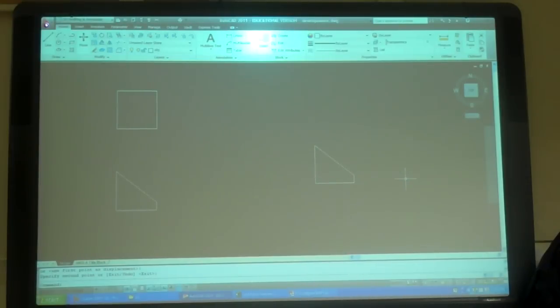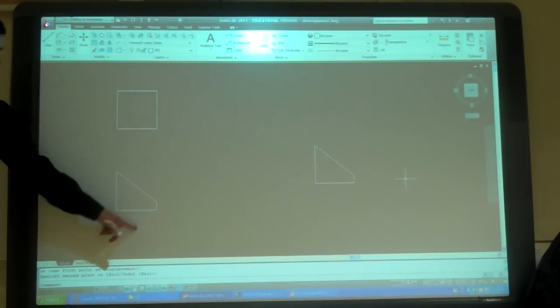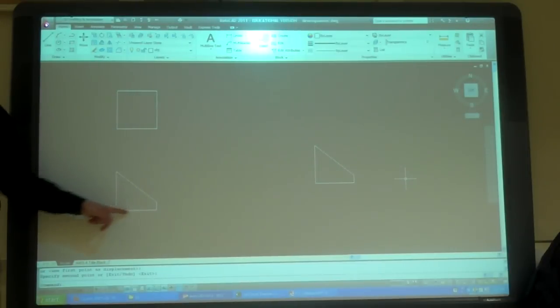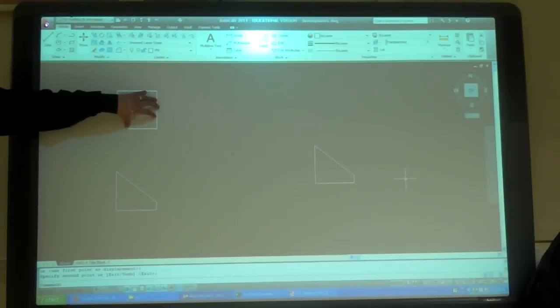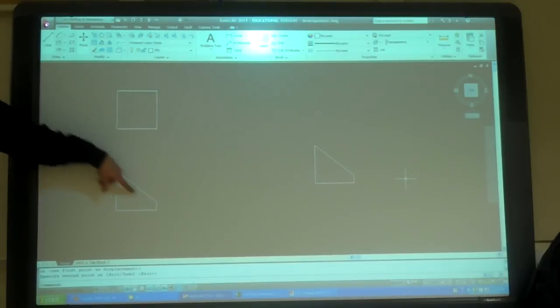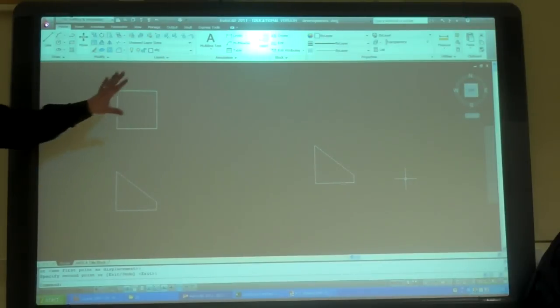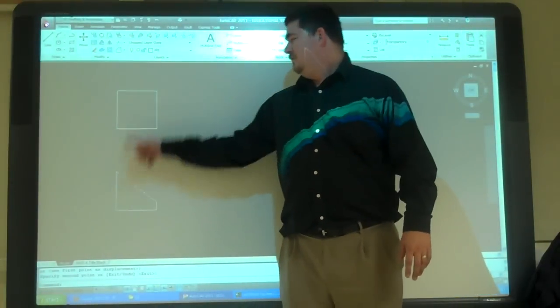The inside? No, that's not true shape. Bottom. Because even though this is the top view, that line is still the bottom, right? Because the bottom is parallel to the folding line. So that means this is the true shape of the bottom. But you said, when I said... You said the top. This is the top. No, I meant the top of that part. As the top view? Yes. But I was asking for surfaces, not views, right? So the bottom surface is that shape.